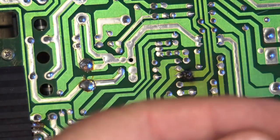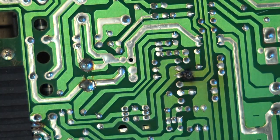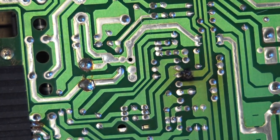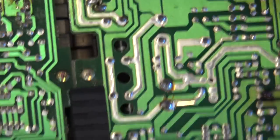And if I cut it, you'll see that, where am I here? See how much I took off there? So that was the problem from the factory, that didn't get clipped off. And it caused a short. Even though there's a rubber spacer over here, if you look on the board here, there's a rubber spacer that's right here, and